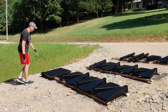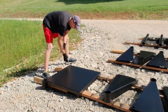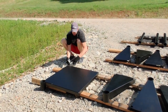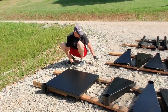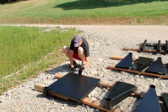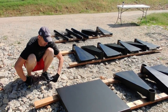So yeah, this is the landing I was telling you about. That's where that pipe is there. And then we have 31 inches on the dot to there. Plus another 6 inches gets us to the edge of the house. So our plate will actually be like 18 inches. Then you have a nice smooth transition so you don't have a trip hazard. It'll come in like this, and then over, and then it'll have the kick down like that, the right angle. And then our gutter will be underneath here. John's talking about how we're actually going to have a plate made.